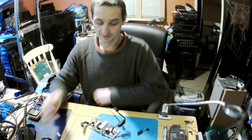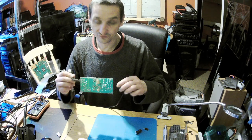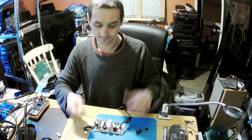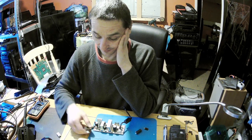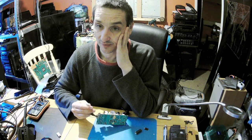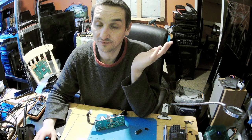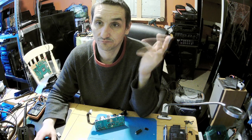So yes, either another power supply or a universal power supply, convert it, plug it in, and this device, we've seen it's working. It doesn't make a short or anything. It's just a lack of power here, which we know is because the transformer is dead. The rest is fine. Probably it's all good and you can use it.